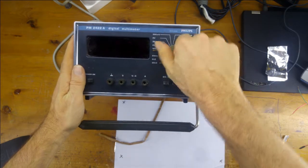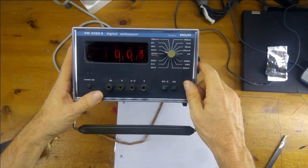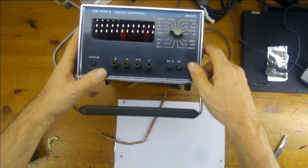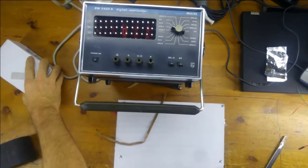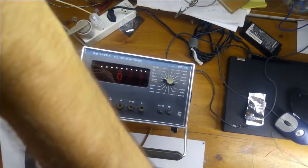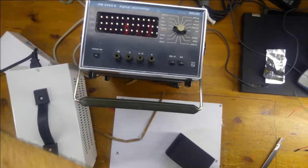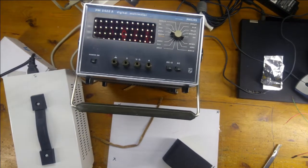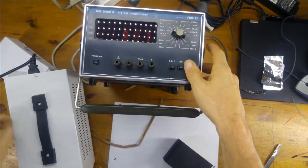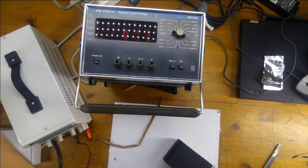So I don't want amps — I want to do some volts. Let's have a look. The 200 volt range. It needs a bit of calibration. I wonder if that zero on its own means everything's cool but it just doesn't have any volts, or if there's something wrong. Let's get out a bench power supply and we'll put some volts into it and see if we can measure something.